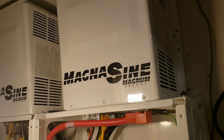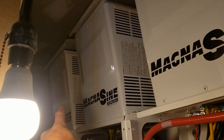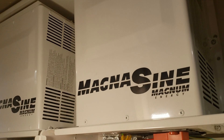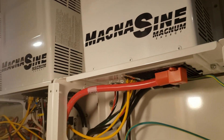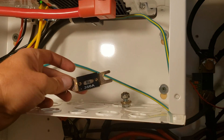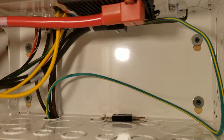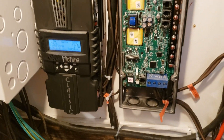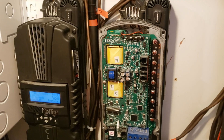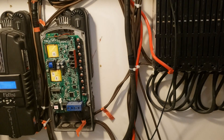We are up and running again — well, enough hooked up to have lights again, which is really nice. This is the master, slave number one, slave number two. I'm actually gonna write right on the inverters what they are. Everything's working great so far. Got a spare fuse — this is what I was using before so I'm gonna take this out — and just hooking up my charge controllers here. I just need a spot for the positive.